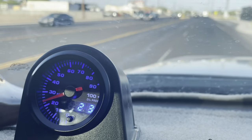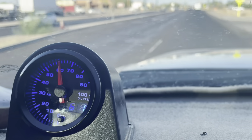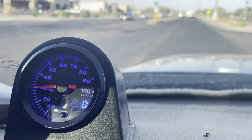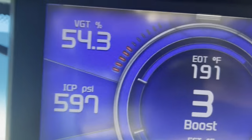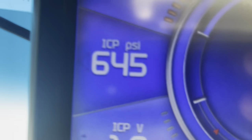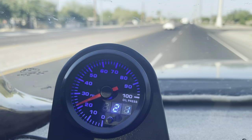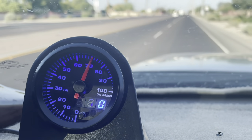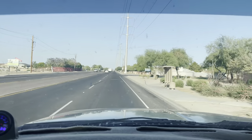Okay guys, so now the engine has warmed up — it's back at 23 PSI with the oil bypass. Let me accelerate a little bit and see what it does — it should go up to 80 again. H-pop is about 600. I see PSI... comes right back down to 26 — which is where it should be. See, the oil pressure did not get affected by the oil bypass at all on acceleration. Nothing changes. Great.